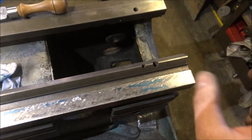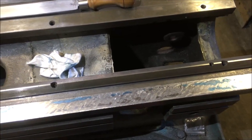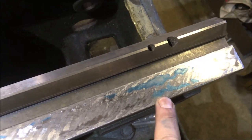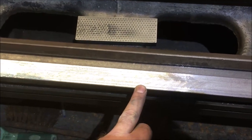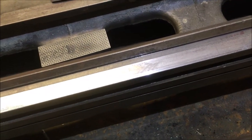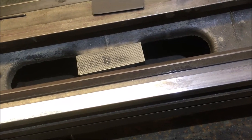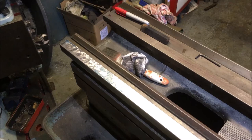What I've done is I've step scraped them out, working from each end. And the difference between, we'll find that blue area there and the lowest point along here is now a thou and a quarter, and the same along here. So that's took 2 hours, and it's took down the total variations a thou and a quarter, which is encouraging.